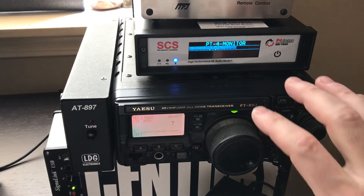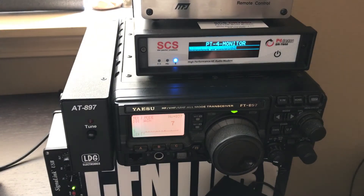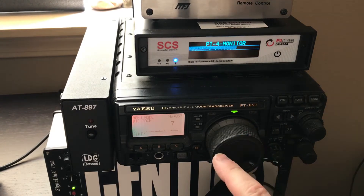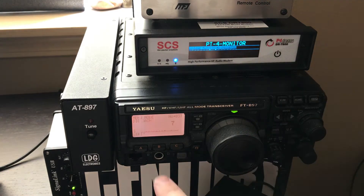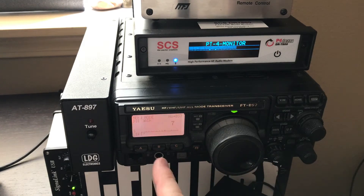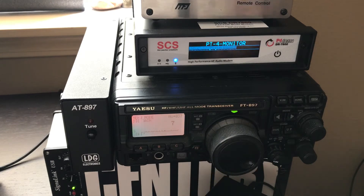With different bands I have some slightly different adjustments, and that has to do with my antenna being harder to tune on certain bands. On the 10 meter band I have a little more SWR, so more SWR results in a little more ALC, and I have to turn the gain down. I'm running at 50 watts, and as I increase wattage the ALC jumps; if I decrease wattage I have to adjust the digital gain further.